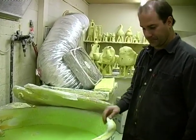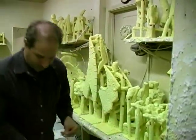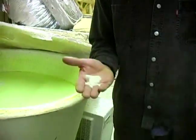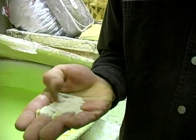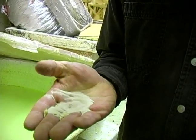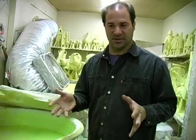This will pick up the detail, and we start off with a very, very fine sand. This is called zircon sand. It's very dense, very fine, almost to a flour consistency. That first coat is what just gives us the detail.